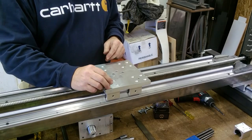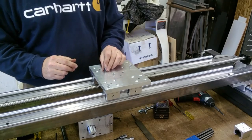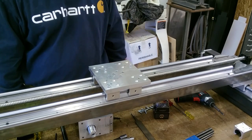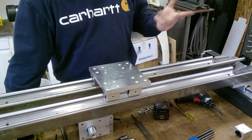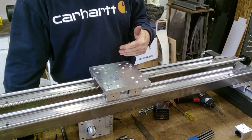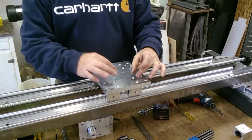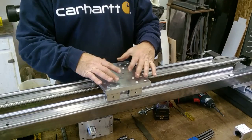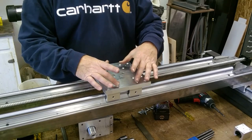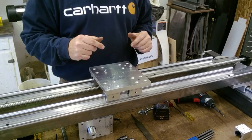The problem was it was only wrong in one spot. I could get the screws in this one, this one, and this one — but this one set of four holes was completely out of whack. I was scratching my head: how did I get three out of four right? I know when I spotted all these holes this was zero-zero. I know these eight holes were completely done in the mill, so even if I finished them on the drill press and they were off, these eight should align. No dice.